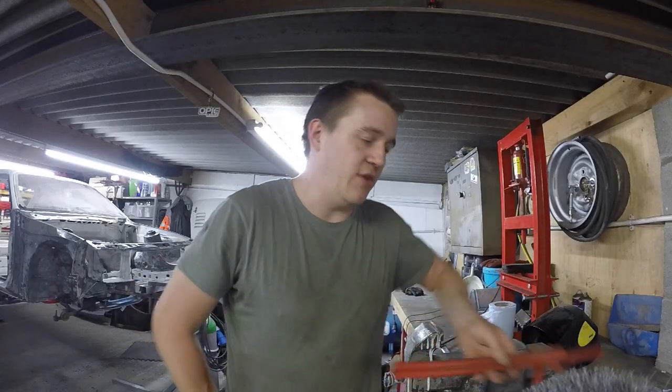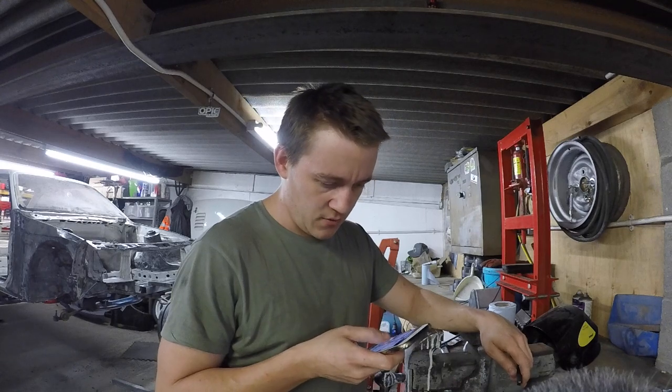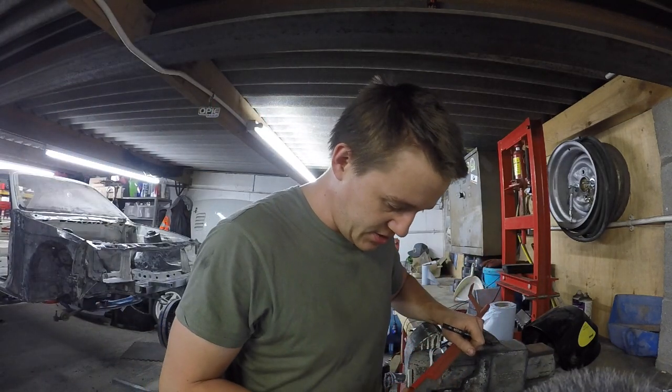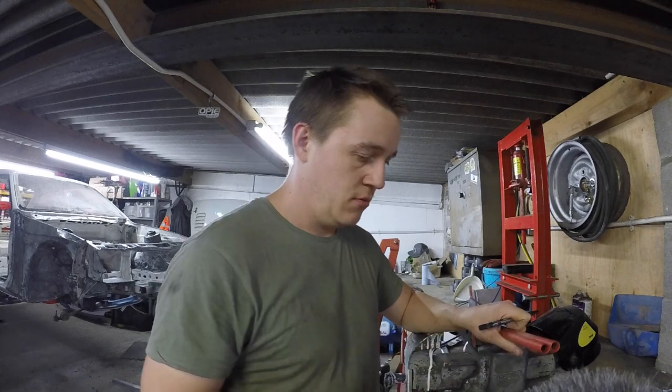So, what do I do? I've got an instruction manual here. It's all in American though, so it's quite hard to understand. Yeah, here we go. So the pickup tube, I cut an inch shorter. Right, we found it. So I need to cut an inch off that, apparently. And then we have to put a drill through it. 5/16. What's that in real money? An 8mm drill we need to put through it.